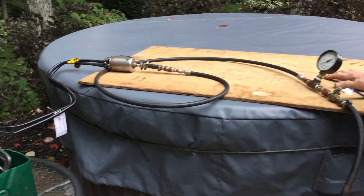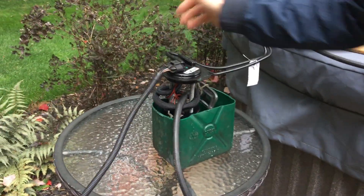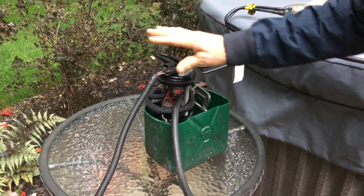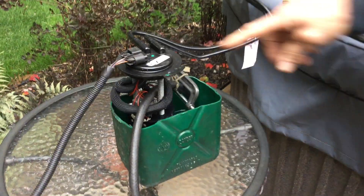I have a battery here far away from the pump because I don't want any spark near the pump. I put some rag on my connectors and I used a connector from the scrapyard so there won't be any spark nearby, because that's gasoline. I connected the inlet fuel filter.